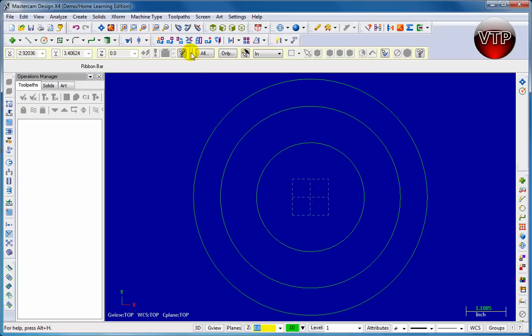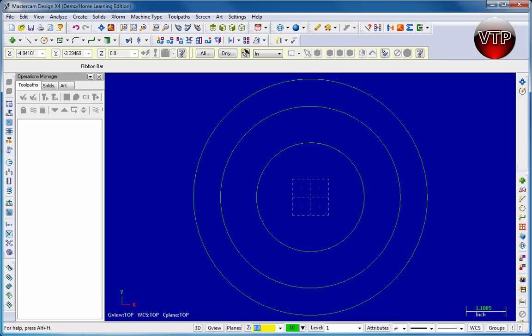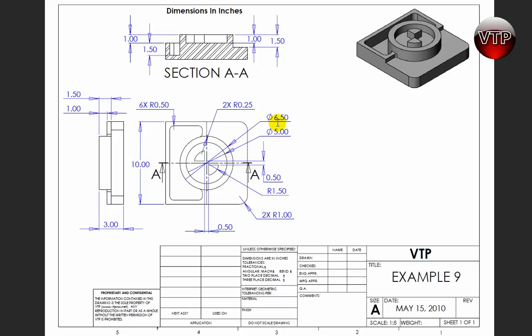Now I'm going to draw the 10x10 inch stock, but on a different layer. The reason I keep going back and forth is that I want to explain why the 10-inch stock is on a lower plane. Remember, we only have the circles that start up on top, and from there the stock begins. So the top is just an extrude boss and the rest is the stock. Let's draw everything onto the second layer.